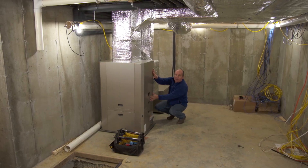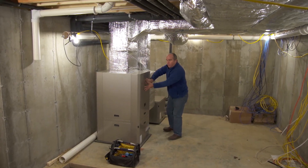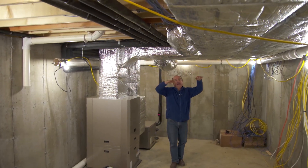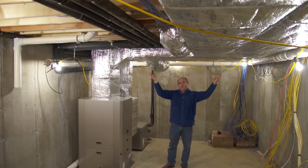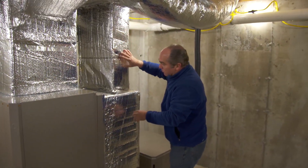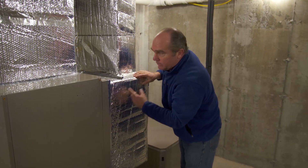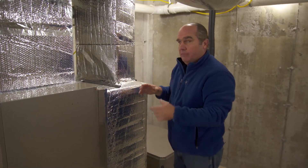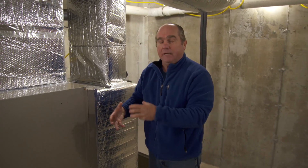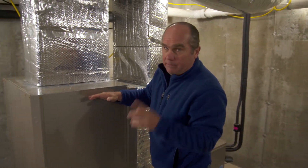Above it is an air handler. The air handler has a blower which pushes air up across the heat exchanger, out through the ductwork and to the first floor through all the registers. That air has to come back through a return right here, with a filter that keeps it circulating. This heat pump doesn't have any combustibles - no gas or oil burner. It just has the heat pump to heat or cool and has an electrical backup just in case.